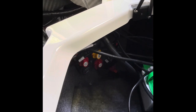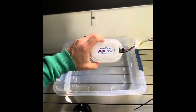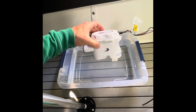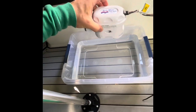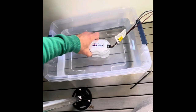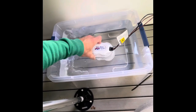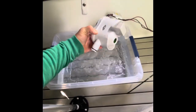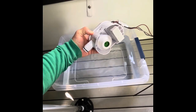On to part two — we've got our Rule Mate 500 gallon per hour bilge pump that came standard with the boat, RM 500 ADM. I'm going to try submerging this in my trusty hefty bucket here and see what happens. And there we go, just like that it comes on. Let it run dry and it should eventually turn off.